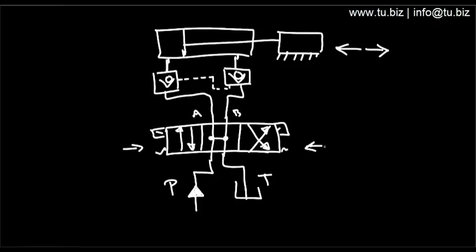Now you do it in the other direction — you need the same thing. You need a pilot line going from this valve to the other valve. When you have pressure going to B, it opens the check valve and tries to retract the cylinder. You also have the pilot line going from B connected to the valve on port A — it opens and allows that valve to stay open for as long as you have pressure on this line. Now the cylinder is allowed to retract, and port A is connected to tank so oil discharges to the reservoir, allowing the cylinder to retract.